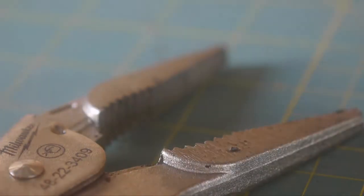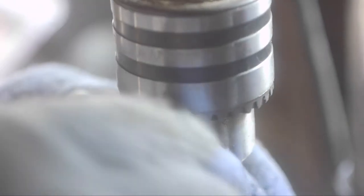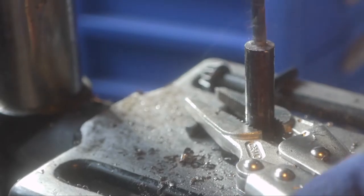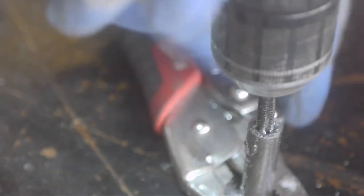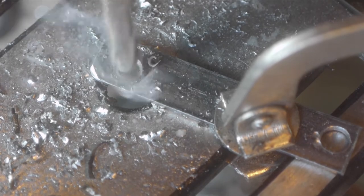Here I'm working out how to build in a custom bookend. I'm taking some of the scrap, doing some quarter-20 threading, welding that back on the frame, and then adding just the right amount of steel round stock with a threaded ball bearing. That's going to be the sort of rotating adjustable end that you can push books up against.